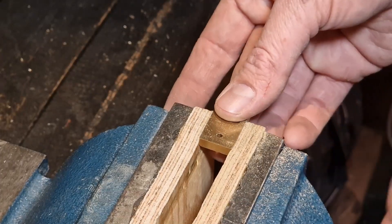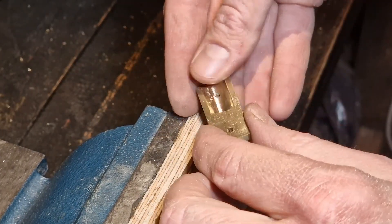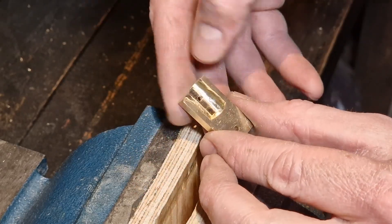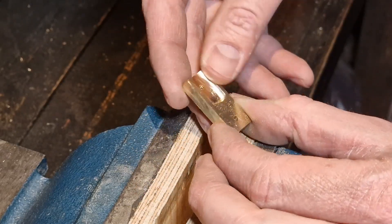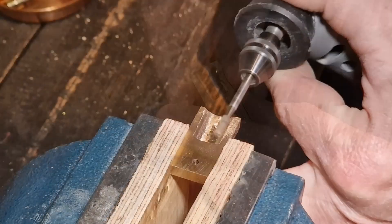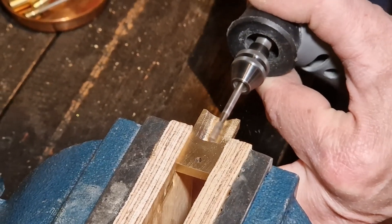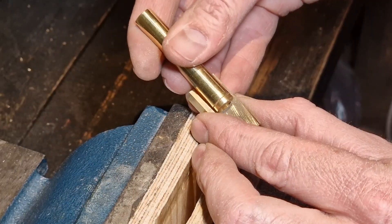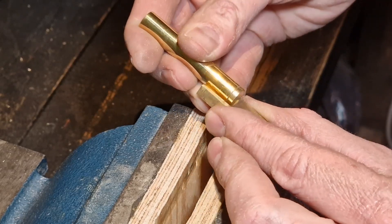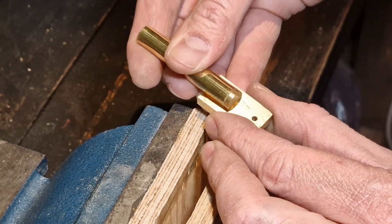The engine blocks are completed, and they turned out less than optimal. I think I need a milling tool to make these grooves a bit better — the drill didn't work as well. I didn't expect it to work perfectly, but I wanted it to work better. With the Dremel I shaped them a bit more, so they're now a bit more oversized than I hoped for, but I think it will still work. I'm going to try to hide these flaws and imperfections with solder — another technique I haven't used before — so we'll see how that goes. Onto soldering.